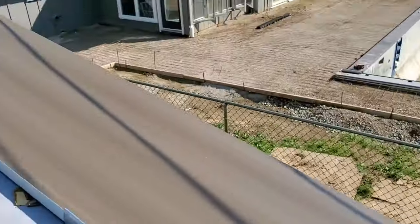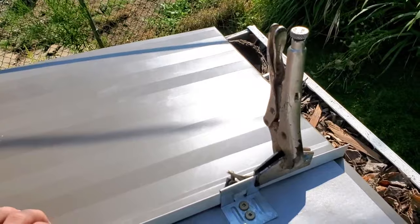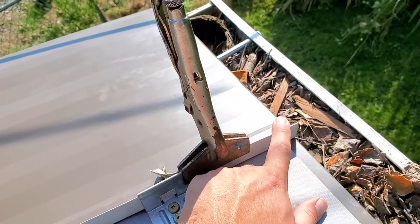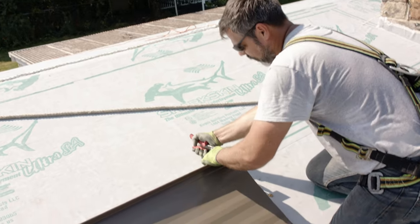For this residential roof, it's a short panel. We've got steel here, and it's a pretty hot day. We've got about a 1/8 inch gap between the panel and the eave metal to leave room for expansion and contraction. So we're just fabbing the ends of these panels.